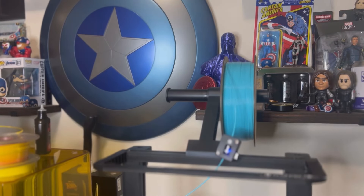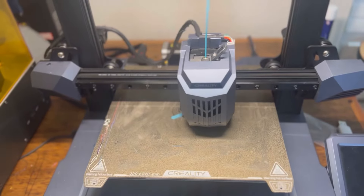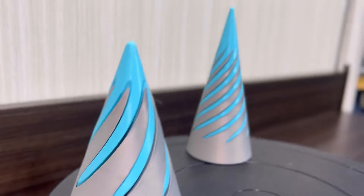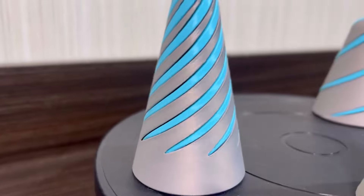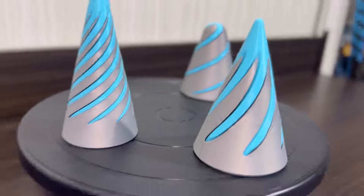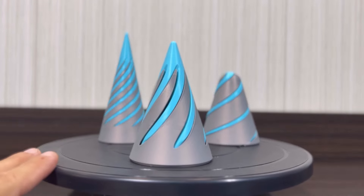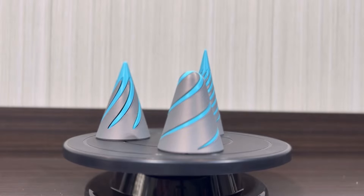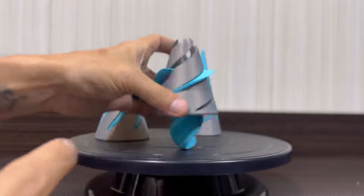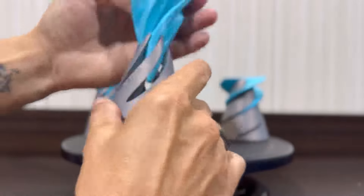It loaded nice and easy, and I immediately began testing on some of my Klipper-based printers. I started off simple with some tree fidgets for the upcoming holiday. Both filaments were printed around 300 millimeters per second — 205 degrees for the Hyper PLA and 210 to 215 for the metallic. Overall, there were no major issues to report. At a 0.2 layer height they came out really clean, contoured, and work awesome. My kids have been playing with these for about a week and the filament is very durable.